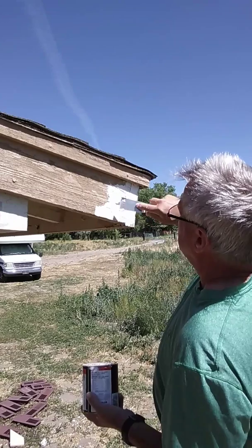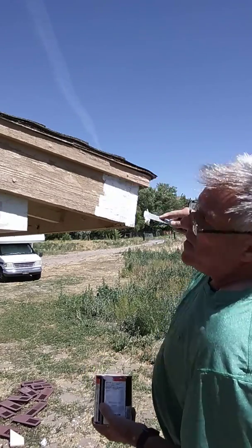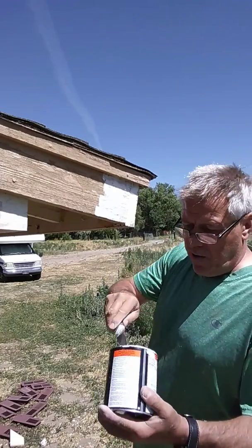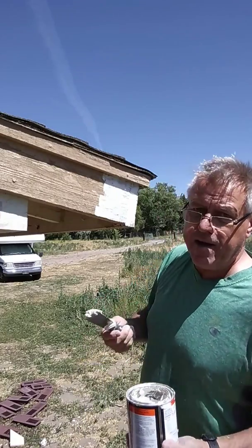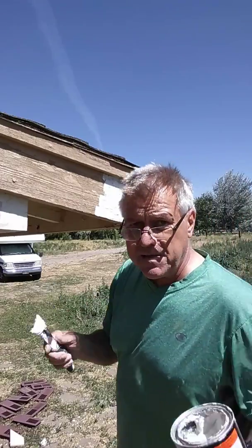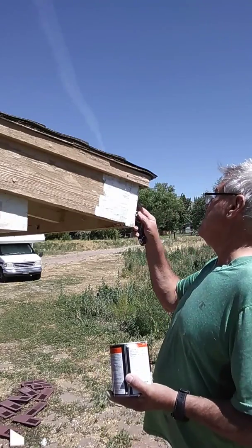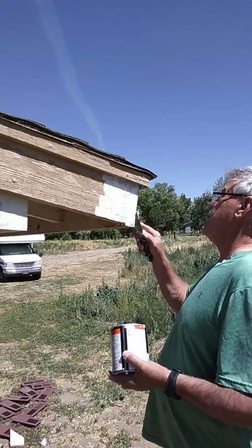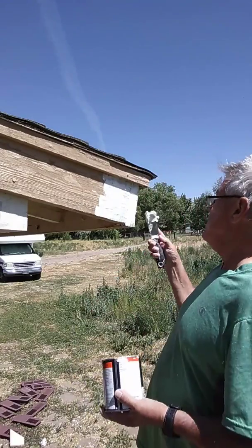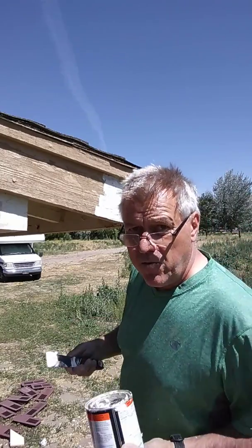I'm going to cover it about 6 inches back on each side. Do the front also. Go over the nails — this will help keep the nails from popping out again. You do have screws in there, but on something like this, every little thing you do works together to keep it together. Putting my Ready Patch over the nails and screws to make it look like a complete corner.